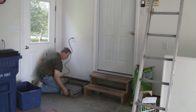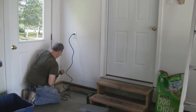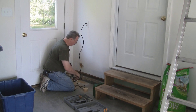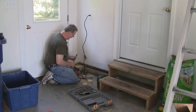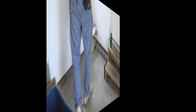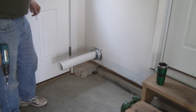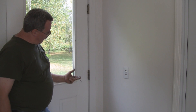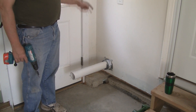So what we're going to do is drill a hole for access to the basement. I've already drilled a pilot hole and it's coming out through wall number one. You get out there one day and you're like two inches shy. What we have here is a fire stop — it's a collar that goes around the pipe. That's required by code because essentially the garage is a separate fire area and it's all covered with fire-resistant sheetrock. This is required in case there's a fire in the garage — it will expand as the pipe melts and close off that hole. There's going to be one here and one on the ceiling.